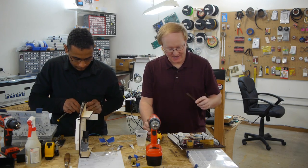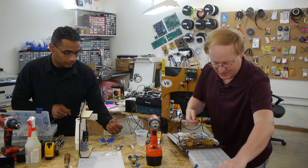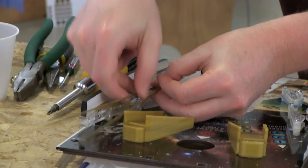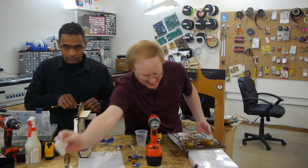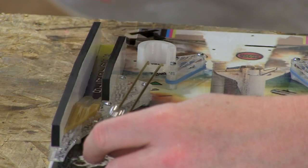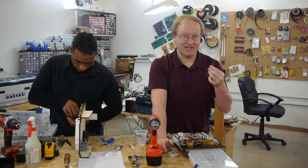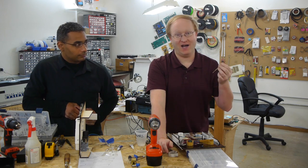I'm going to start working on the ramps now. My idea is to use these brass rods as guides — they'll stick into this cup here and then attach to a curved piece up here which comes off the ramp. The ball will come down this path and be fed right into the in-lane very nicely. For a switch, we'll actually hook wires up to these brass rods, so when the ball touches them it'll complete the circuit and we'll know that the ramp was hit.